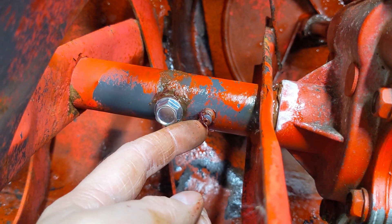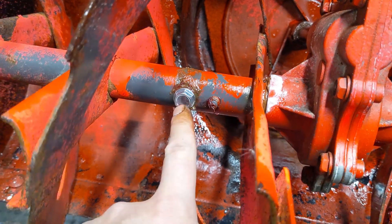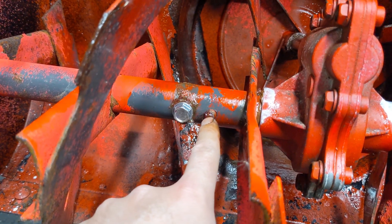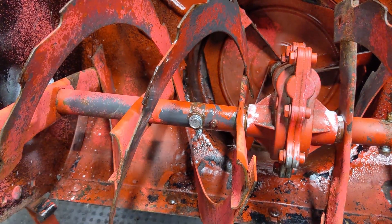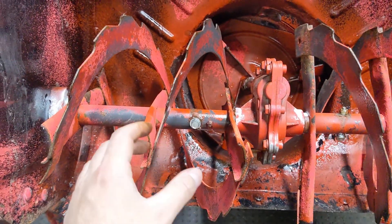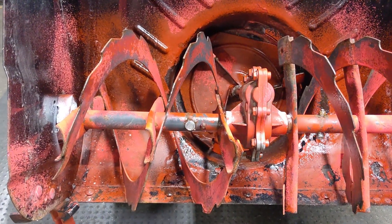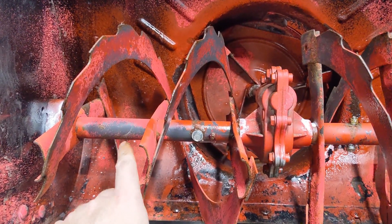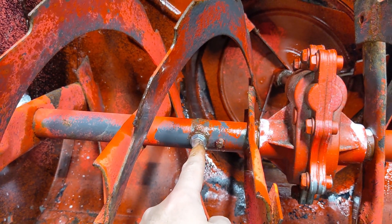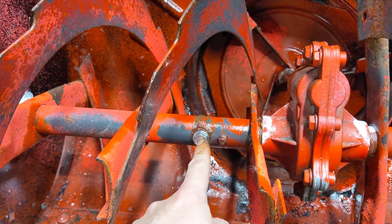On a lot of snowblowers you'll see little grease fittings — we've gone ahead and packed those full of grease. If you have shear bolts installed, remove them, hook up your grease gun, and pump grease in while spinning the auger fin around. That allows grease to travel down the entire shaft so that the fins just slide off during disassembly and won't corrode in place. It also pumps grease into the hole where the shear bolt goes, because if the bolt seizes it may not properly shear.